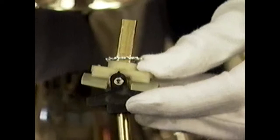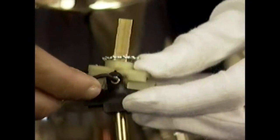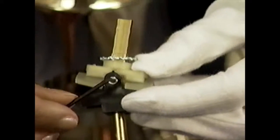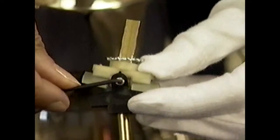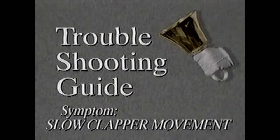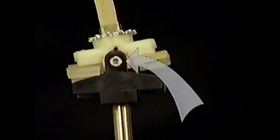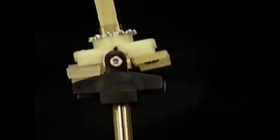For any other loose sounds, check the bearing screws. If you find side-to-side movement of the clapper shaft, simply tighten the bearings, but not too tightly. Bearing screws that are too tight will result in hesitant or slow clapper movement. Another cause of slow clapper movement might be lint, dirt, or polish accumulated in and around the bearing screws — clean the area with a lint-free cloth or lighter fluid.